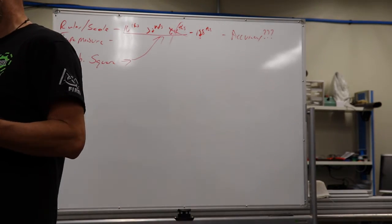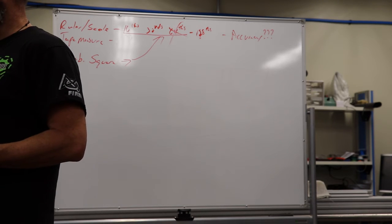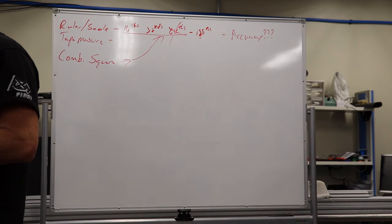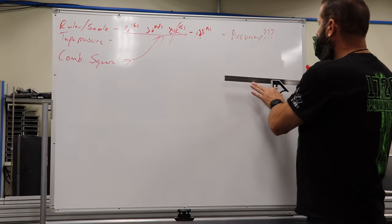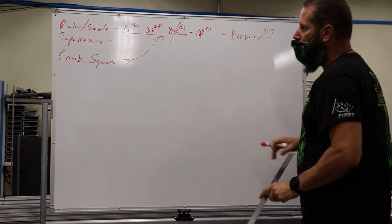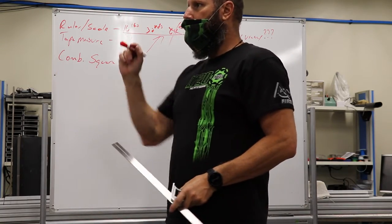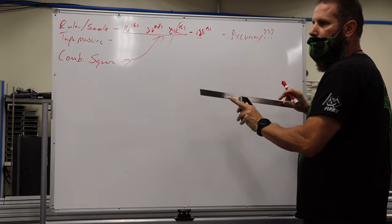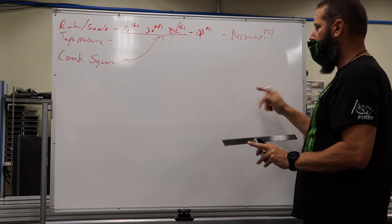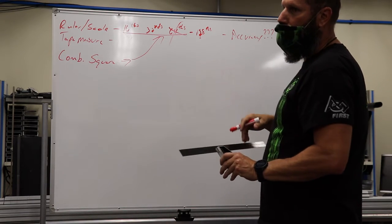It would be good to keep something square. I like where you're going with this. Measuring anything with angles, whether it's square, protractor. Right. So when we're doing our laying out, I had this piece up here, so I would lay this out. A lot of times, when we're doing things, geometry will be the same for multiple things. So everything might be in one plane. So this allows me to set up on the corner of that and to lay out a line that is perpendicular with this side and hopefully parallel with this side, depending upon if my piece itself is actually even square.